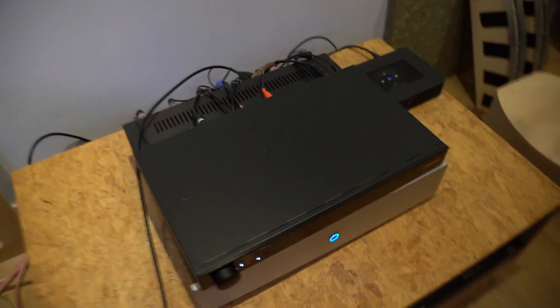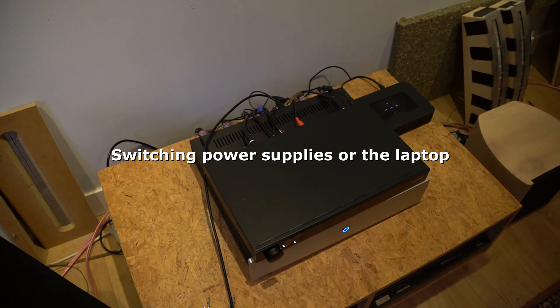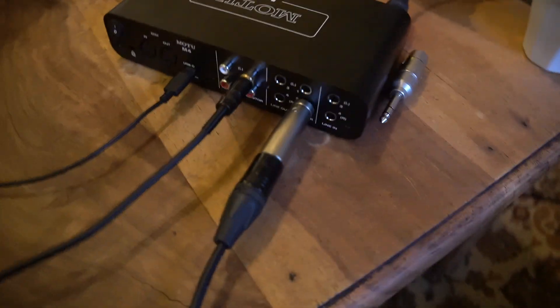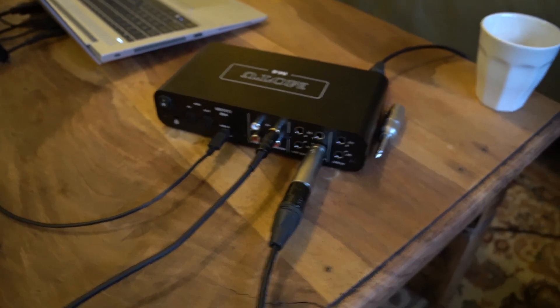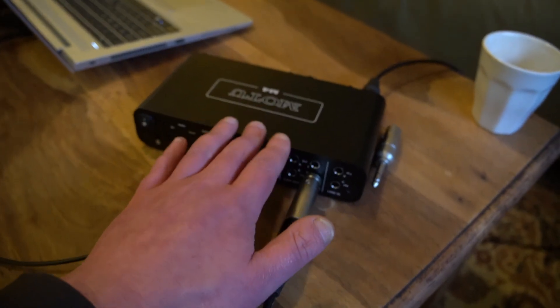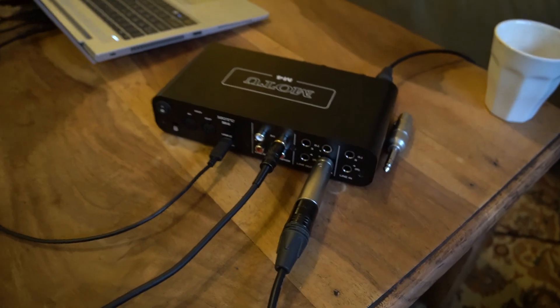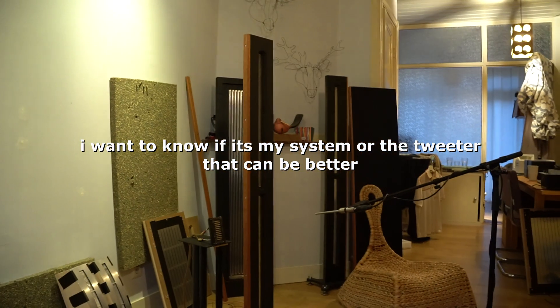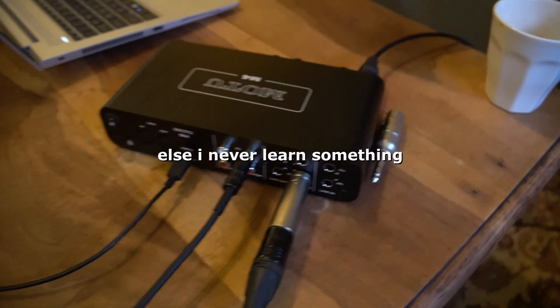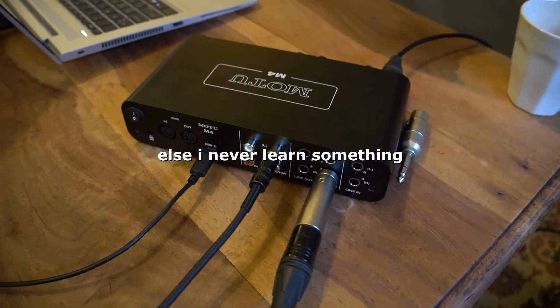It's quiet — completely quiet. So it was interference from somewhere, maybe the Hypex amplifier, the DSP, or something else — I'm not sure, but it's dead quiet now, so that's good. Now the question is why I didn't see 20kHz since I have this device. I want to make sure I can measure at least 20kHz; beyond that I don't really care, but if I'm playing with tweeters and it drops off at 16kHz, I need to know if they actually reach that.